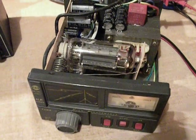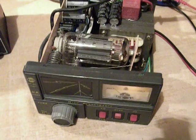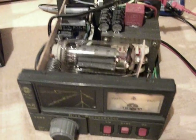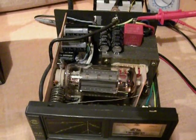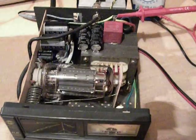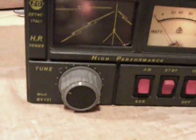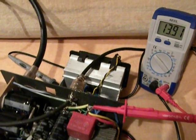As you probably know, the main problem with the transistor linear amplifiers is the SWR, which kills the transistors. And of course, inside the car or truck, a tube linear amplifier would be great. The problem is that they require a lot of voltage, mainly for the anodic voltage — it's often around 1kV or 600V — very much to be obtained from a battery of 12 or 24V. But today I've just modified a classic Zetagi BV-131 so that it is able to operate within 12V from a car.